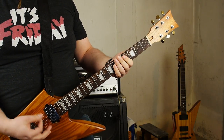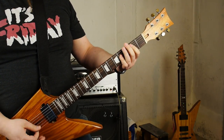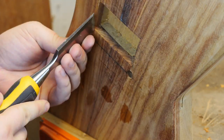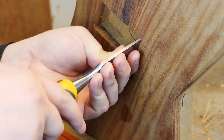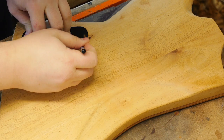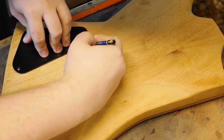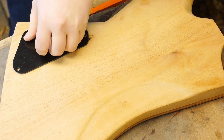Now that I've built a guitar out of utter hubris after watching one guy on YouTube do it and deciding I could too, what have I learned? First, I really should have bought templates — especially for the pickup cavities. I wound up doing a lot of guessing and resizing after carving, and ended up with weird pickup holes that are very tight and square. I also really need to pay more attention when tracing existing parts — I traced the rear cover plate upside down and didn't notice, so now my control knobs are pretty far away from the playing hand.